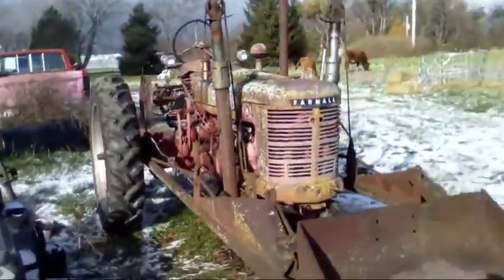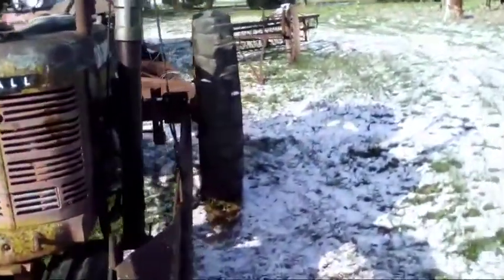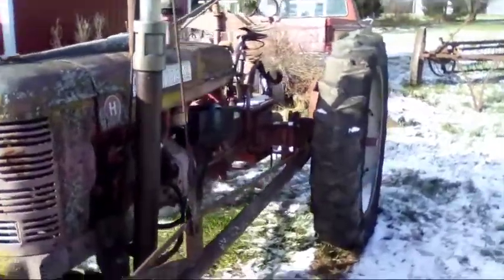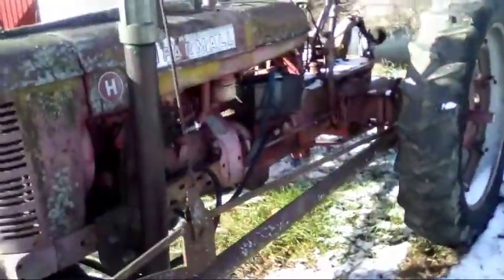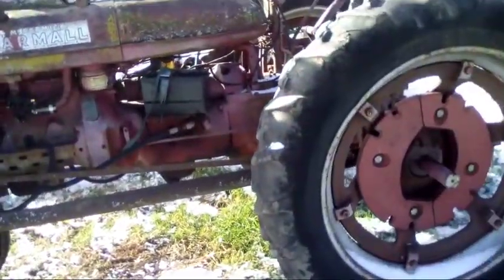If that doesn't pan out, I've got a lead on a AutoZone part that looks different but fits, and it's a higher temperature, which is supposedly better for the machine. It's a 180 degree and the stock one is 160 degree.